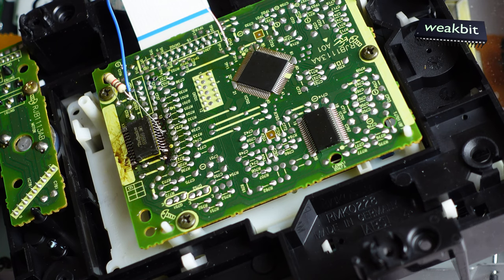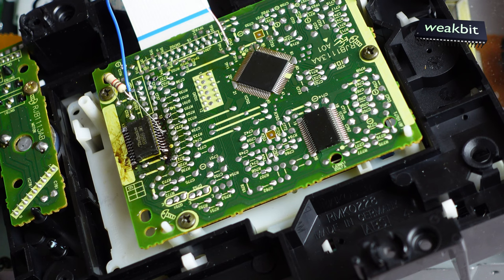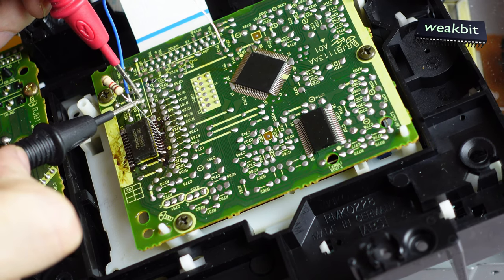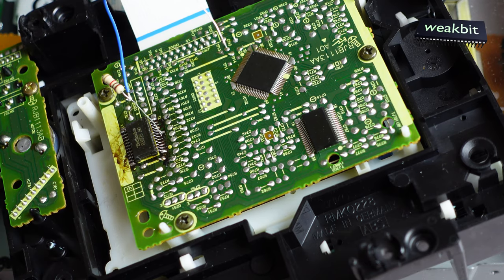What can happen? The motor is not defective — I can measure the motor ohms. Switching it off, measuring the resistance: these two pins have 11.44 ohms — that is normal for a motor like this. Also the connection between the driver motor and the driver — pins 15 and 16.